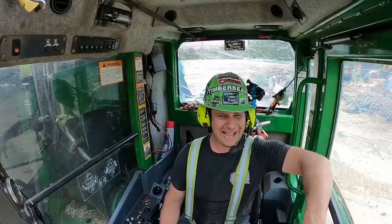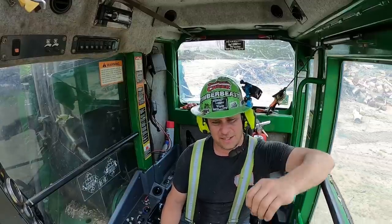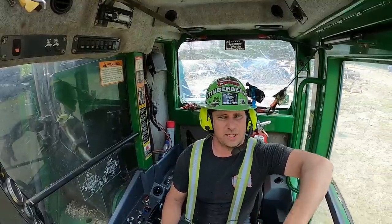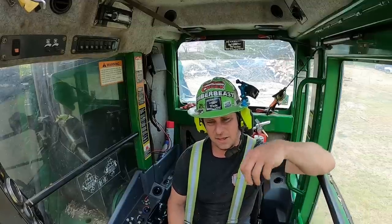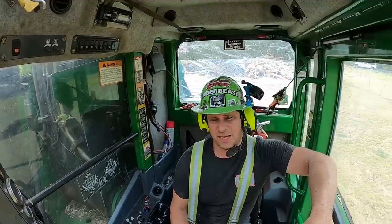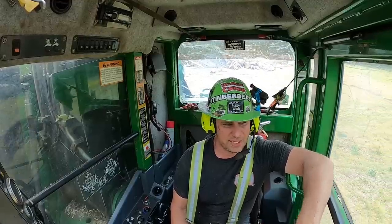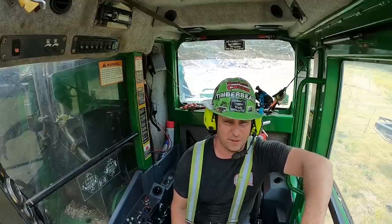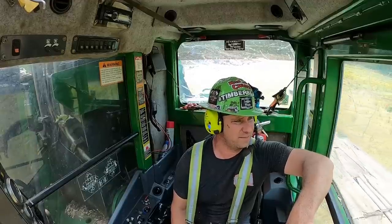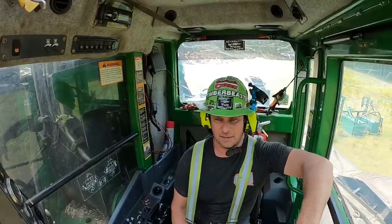Go for flow. So anyways, the last item in an assembly line needs to be your slowest. So according to that, the cutter needs to be the slowest machine on the job site, and the job site needs to be adjusted to where that boom is always filled up. She'll never miss an opportunity. Even if the skidders miss a little bit of an opportunity, ain't a big deal. As long as she's stuffed full, got wood set in front of her at all times, she does her however she wants to, but she needs to always have wood sitting there. When she feels like throwing a stick on the table, that stick needs to be sitting there.